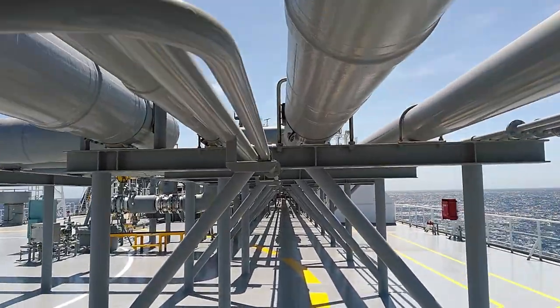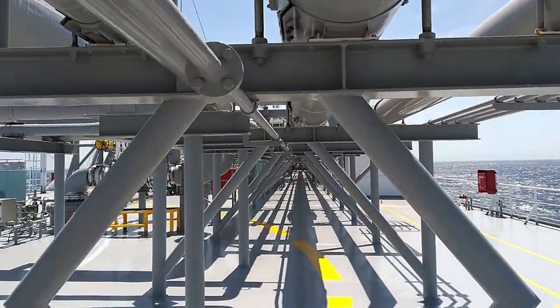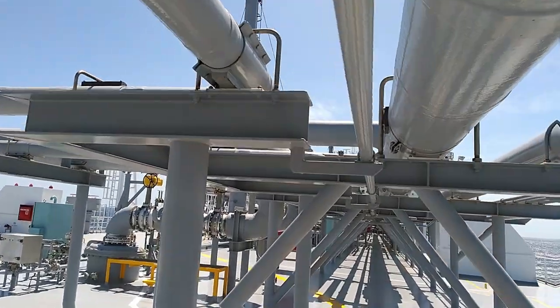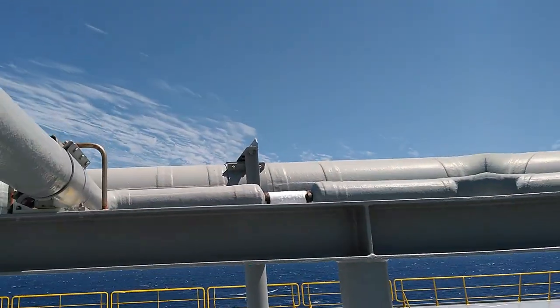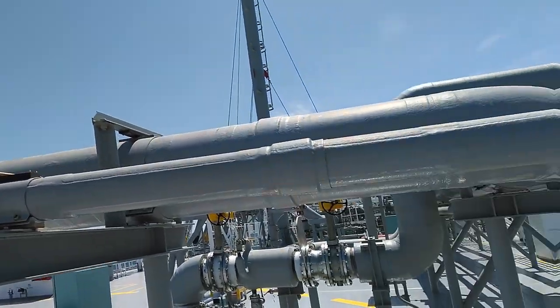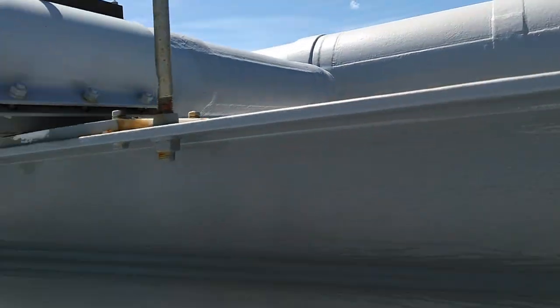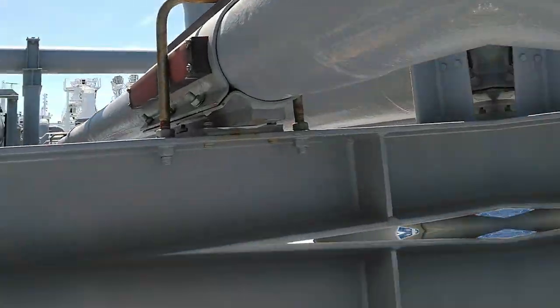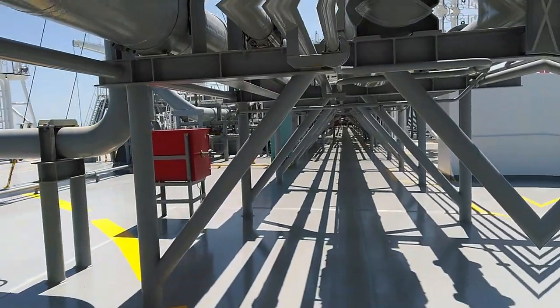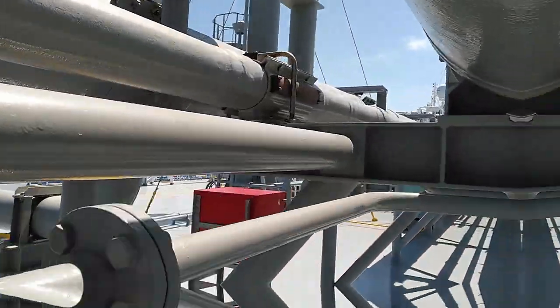It's very important to remind you that during cooldown operations, no hot work is to be performed on deck. All crew must be advised about the operation and we need to inform the bridge to pay attention on deck.